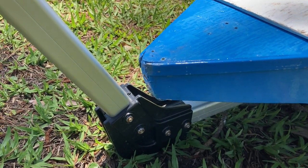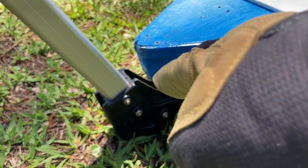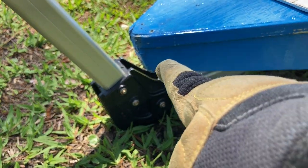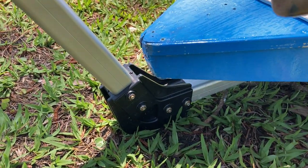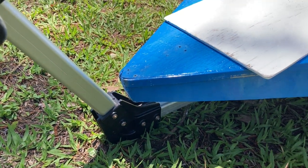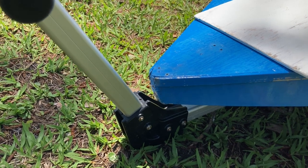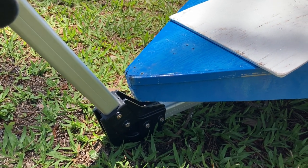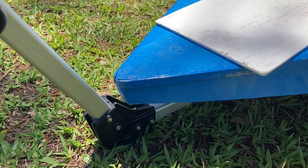There's a lot of stuff happening up at the bow. They've got a plank coming in from either side, deck, hull, a wooden stem underneath, and a longeron on the deck. Another longeron in the keel coming in, so we're gonna clean that up a little bit, apply some thickened epoxy to seal up the little small bits we had.